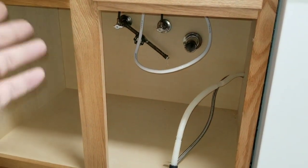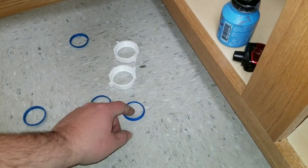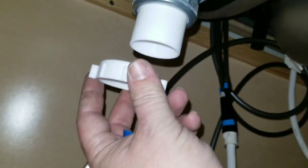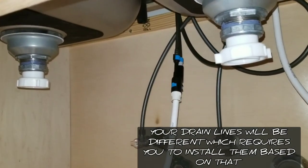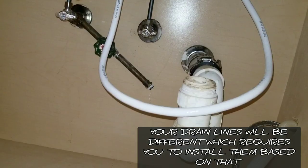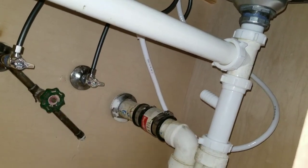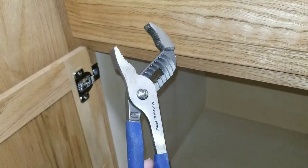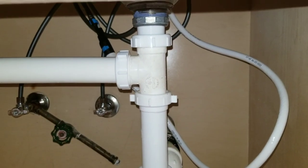All I have to do now is get over here, hook up all these drain lines to the brand new sink, and then test everything out for leaks and make sure everything runs right. No matter what you end up doing to hook up your particular drain lines, I'll show you the basics on how I'm hooking this one up. Slide the lock nut on first, then get your washer in here — slide it up, it'll hold everything in place. Same thing on both sides. Once that's done, you can configure how you're going to run your drain lines. Finish getting everything assembled, then test it out to make sure nothing is leaking. Get all these drain lines hooked up exactly where you need them. I like to put the one for the dishwasher facing toward the back to conserve room behind everything. Get your channel-lock pliers — I like the ones with a little bit of a round jaw because they grip better — and start tightening up all those nuts. Make sure you don't over-tighten them, just tighten them.